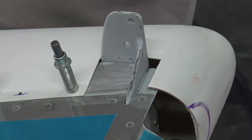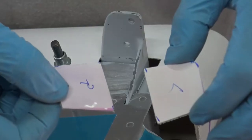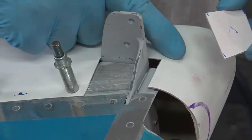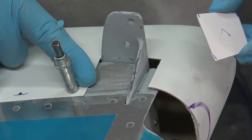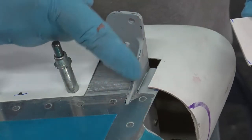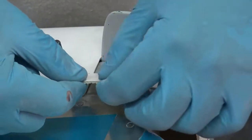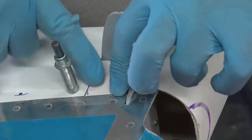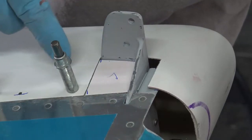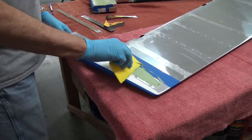Fit and fill. We are fond of saying here at the Skunk Works that you never throw anything out. Right and left. When we cut this notch in the rudder base, there's no way to get it around this angle without just cutting a notch in it. But you never throw anything away. These little pieces that came out of there, do a little massage on them, they go right back in there. That's a whole lot less area to have to fill to clean up. So, sand, fill, and repeat, as the title says.